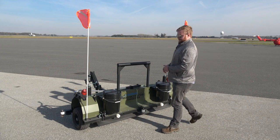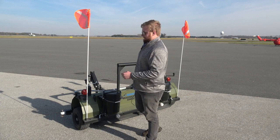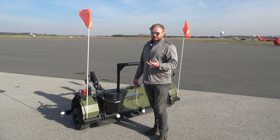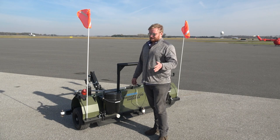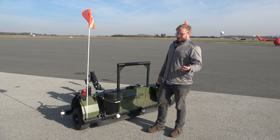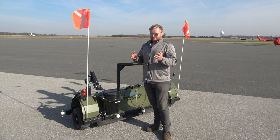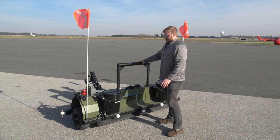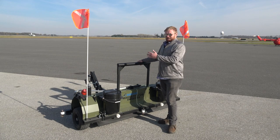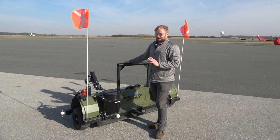On either side of the magnet we have Carlisle flat-free wheels — 16.5 inch wheels with a 2,000 pound, 5-bolt rated hub and spindle assembly. It's just like anything you'd see on a normal trailer, with an actual hub, spindle, and wheel bearings — not just some slip-on things. Very heavy duty. The magnet itself only weighs about 1,100 pounds, so with a 2,000 pound rated hub and spindle on either side, it's overbuilt for what this trailer is.